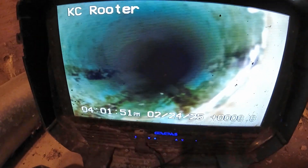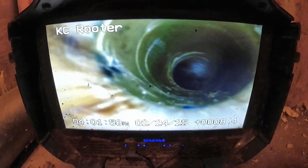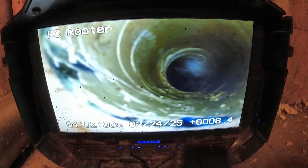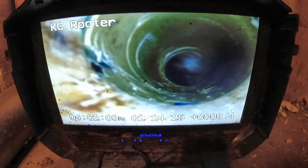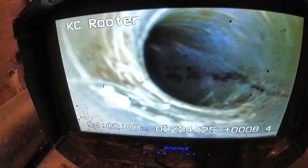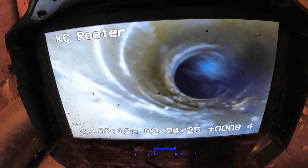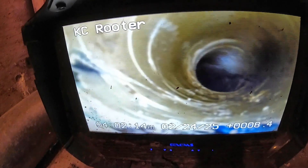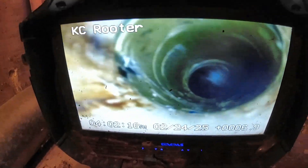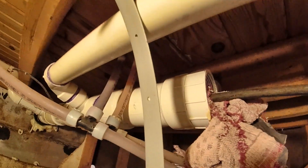As you can see, it turned out perfectly as I expected. I'm still not convinced that's a 45 — it might be even a 22-degree fitting right there. Regardless, it turned out exactly as I wanted to. It covered over both those joints, and directly right here is actually where the three-by-four transition happens. They actually stubbed SDR 35 inside of the house, which is a no-no, and reduced it down to three inch — so that was what that was. Everything else looks good, and we'll give it a couple weeks and then check back with the homeowner and see if they smell anything more. They better not. We're all good to go.